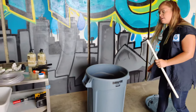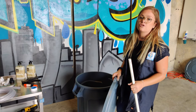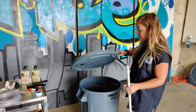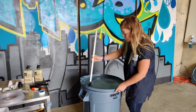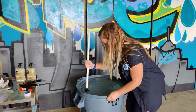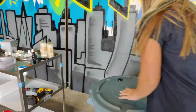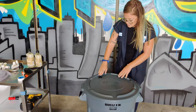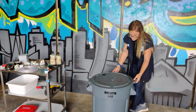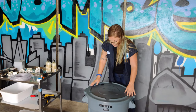I'm not gluing just yet. I highly recommend constructing the entire unit including the galley pump and all its attachments, then doing a dry run to make sure that everything is working properly. Then let everything air dry or towel dry every single piece before gluing. You would glue the PVC pipe into the bulkhead union washer fitting. Once that's there you can put the lid back on and make sure the PVC pipe is not touching the bottom of the bin.